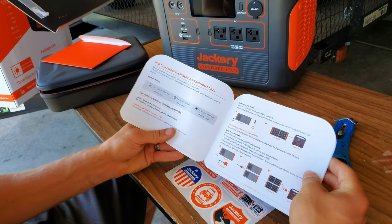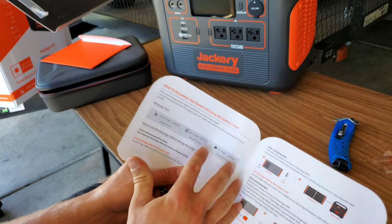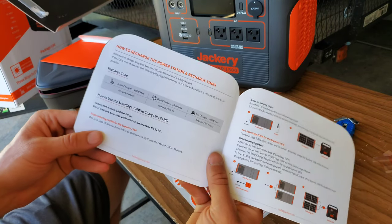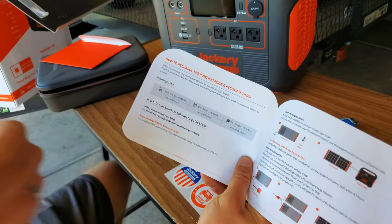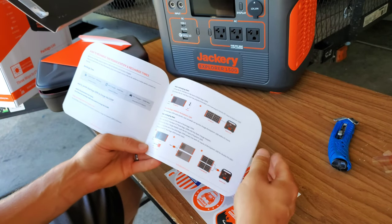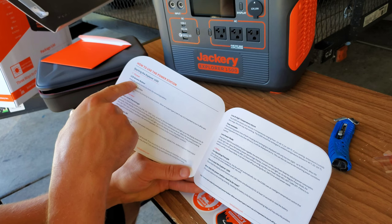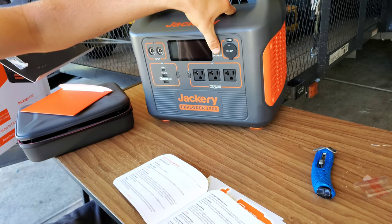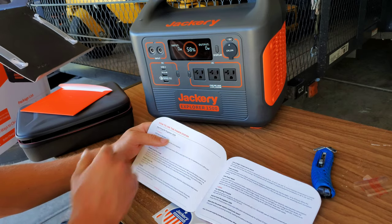How to recharge the power station and recharge time: with your solar charger, it's 400 watt max output around four hours; a wall charger, 500 watt max around three hours; and your car charger, 100 watt max around 15.5 hours — so there's obviously a big jump there. How to use it — recommended solar setup and all that. How to do it with one panel, how to do it with multiple panels, how to use the power station. Obviously press the power button to check remaining battery. So the power button is the LCD display button. It's set at a 32-second auto power off display, so it turns off by itself.